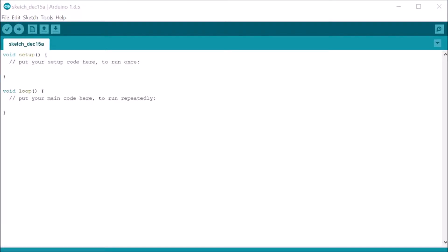A library is a set of functions and code made by other people to make it easier for everyone to code what they want, instead of spending time learning extreme details about every little thing. There are many libraries that come already bundled with the Arduino IDE, but not the one we want to use for this specific project. The library you will need is called Adafruit NeoPixel and it will help us greatly with the LED portion of our program. A link to that library is also provided in the description below.